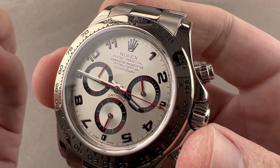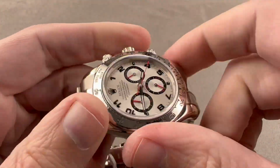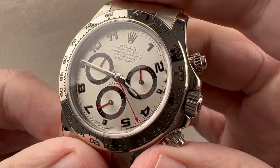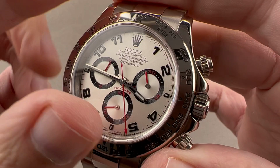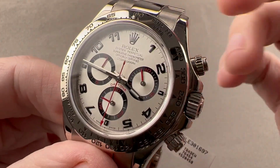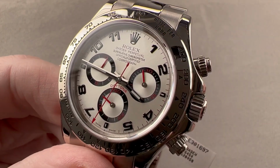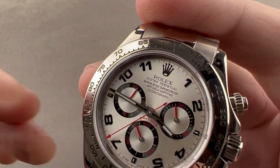It has a handmade overcoil hairspring that allows it to keep even time in every position. That overcoil hairspring is made of a niobium zirconium anti-magnetic alloy. At this point in 2006, it wasn't blue oxidized, but it was the same basic alloy. The movement also features a full balance bridge and a free-sprung balance for toughness and precision of adjustment. And the watch does include a little bit of luminescent material and Luminova on its dial. So not brightly lumed, but sufficient to read.